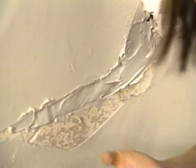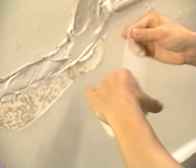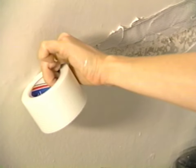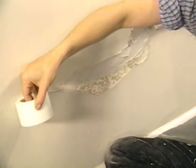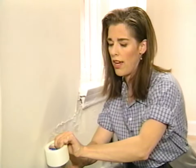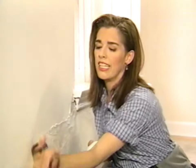I've basically built out the deep, dark crevice so that I can apply this tape — assuming I can find the end of it somewhere. The all-purpose drywall compound will shrink a little bit as it dries, but it will be better than that spongy affair I had the first time. It's really an irritation to have integrity in your home repair, but you know what? You'll be happier with the results.